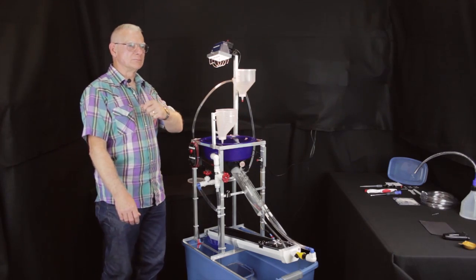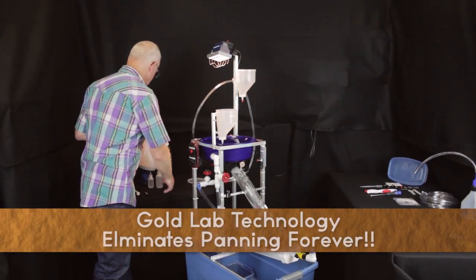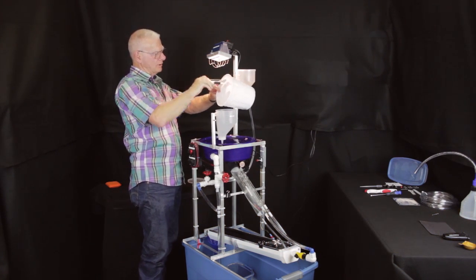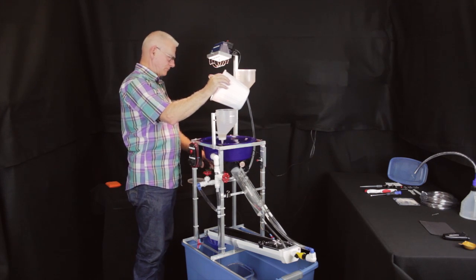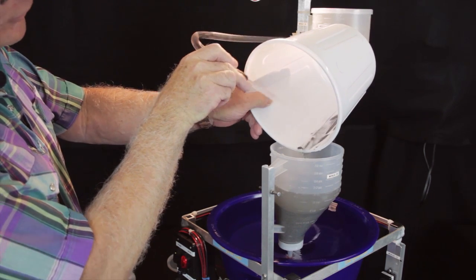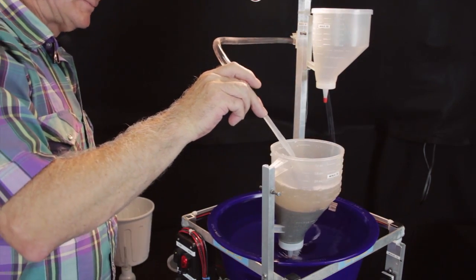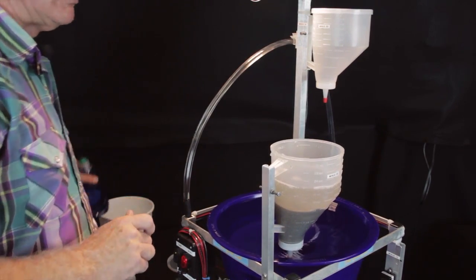Okay Vern, do we have some minus-30 ready to go? And there it is — looks like we've got maybe 8 or 10 or 12 ounces. We'll just go ahead and take that product. We'll use our water supply hose, turn on just a little pin stream, and take our product and turn it right up in there. We'll add this to our hopper and wash it out real nice so we don't miss a thing, because we know there's going to be a lot of fine gold in here. Fine gold is what the Gold Lab is all about. Got that all cleaned out real nice. We'll set that cleanup bucket aside, turn off our accessory water, and put this right back in where it's at.